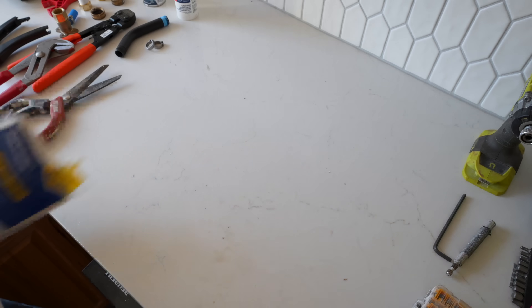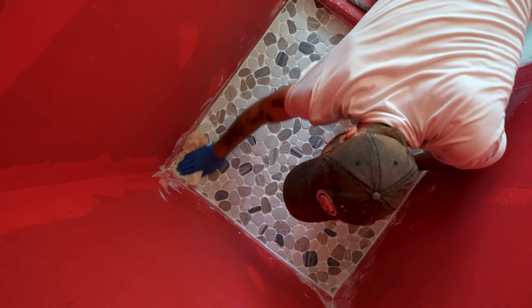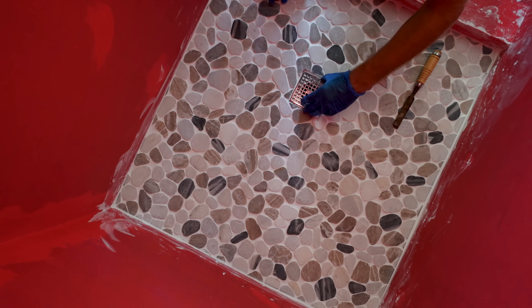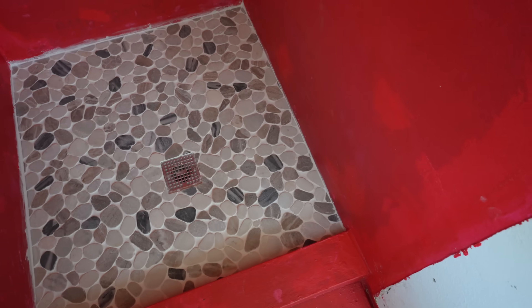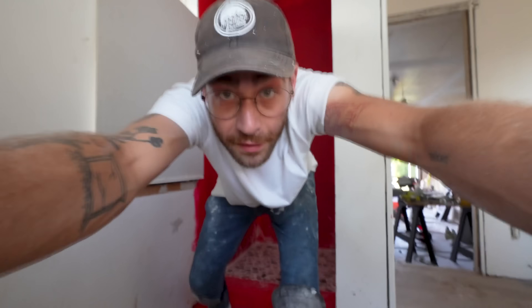The directions say to let this sit for three hours and come back with a cheesecloth to remove any haze on the surface of the tile. This is also a good opportunity to do a once-over on every tile to make sure you don't have any thin-set on the face — if you do, you can use a clean chisel or a razor blade to scrape it off. I'm using an old Harbor Freight chisel to clean out the recess for my drain before screwing it back in, and I also used it to get a good reveal on the grout line around the perimeter of the drain. And we are done. If you want or are required to, you can apply sealer to your grout and tile, but I don't need to — I want to keep that wet-dry difference in look so I'm leaving it. In the next episode we're going to be tiling the walls, so make sure to hit subscribe and the notification bell. As always, I appreciate the support and we'll see you next time.